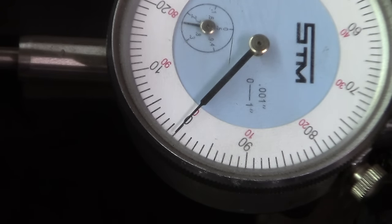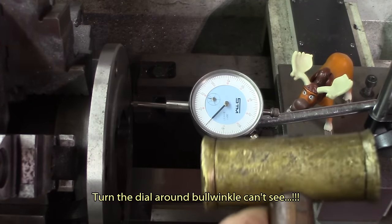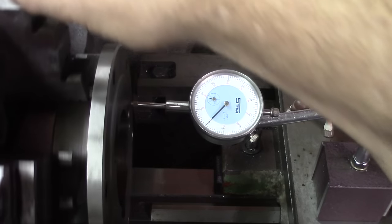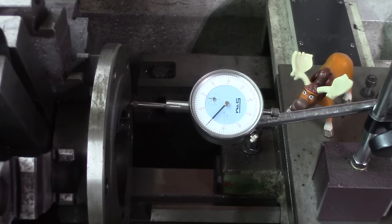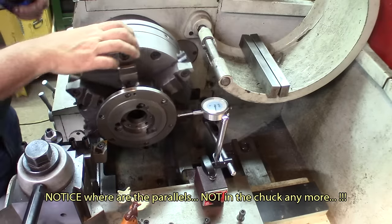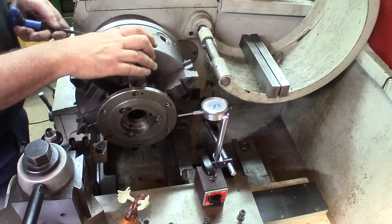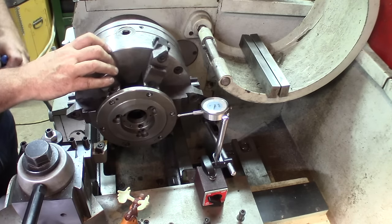I think we're pretty much within a few tenths. To get this straight it's just by tapping a little bit and fixing that registrable base against the parallels — a few adjustments tightening up the chuck. After loosening it I've got about six or seven thousandths of runout, so you adjust the runout a little bit like you would do in a four-jaw, by playing with it.